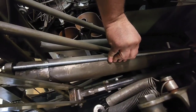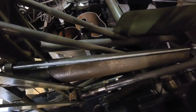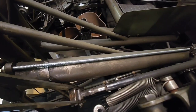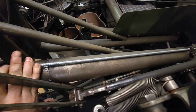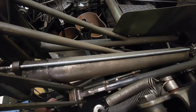I'm gonna hop down around front and compress the rake shaft with my foot - compress that spring tube a little bit - and reposition the nut so I don't have any spring tension. All between the rake shaft and our deck lift shaft. I'll go in there maybe a quarter inch, a little more - sometimes more is better, maybe a half inch for compression.